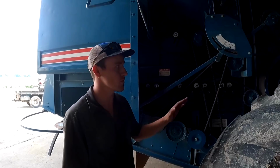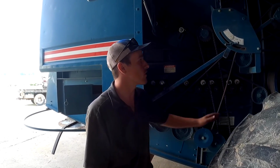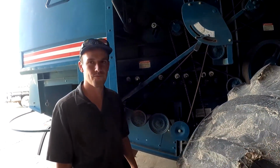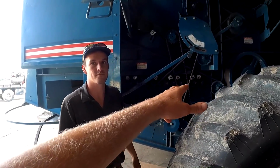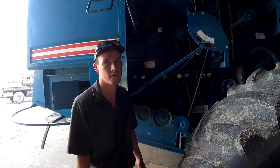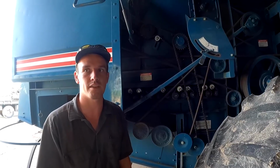And then if you've increased those all the way and you're still seeing good peanuts coming out of the vacuum machine on the vine, that's when you can start engaging your retention board. So you should start completely disengaged, like when you first start. And then the tougher the peanuts are, that's when you would want to engage that. So it's just kind of like a fine tuning, kind of a final step if your peanuts are really green and tough and need more threshing. Basically, it just keeps the vines in there a little bit longer, allows the cylinders more time to separate the peanuts from the vine.